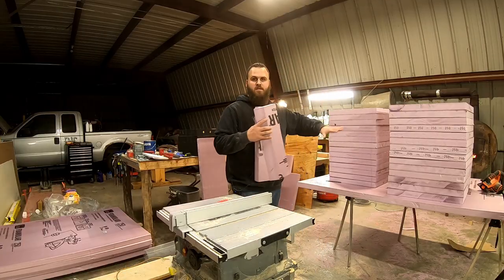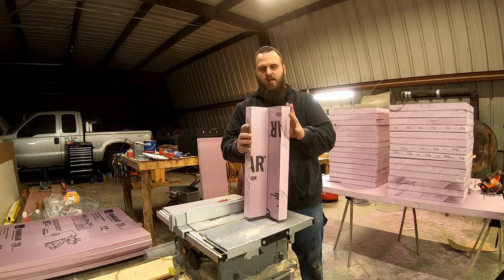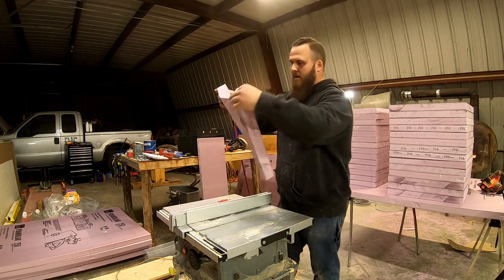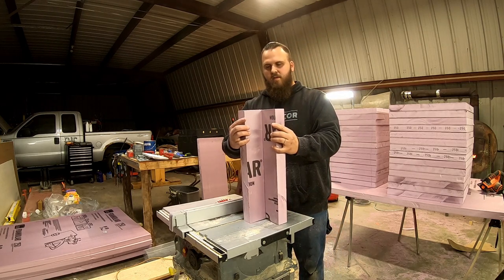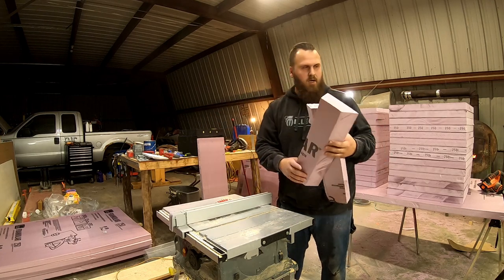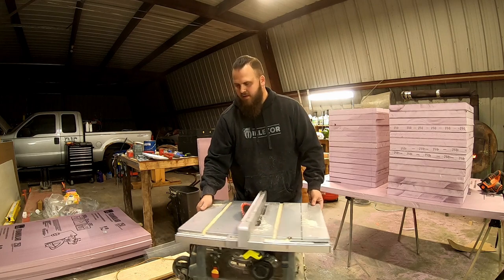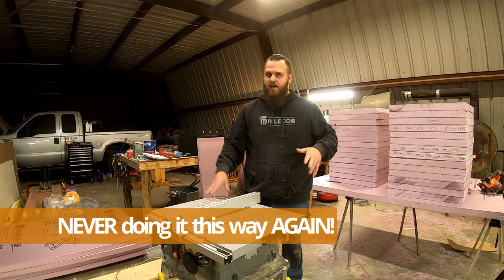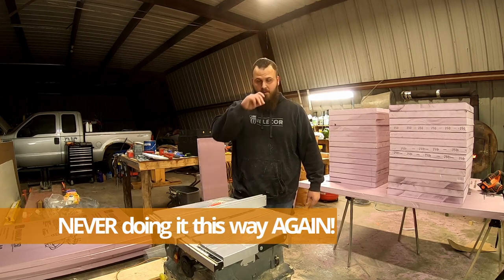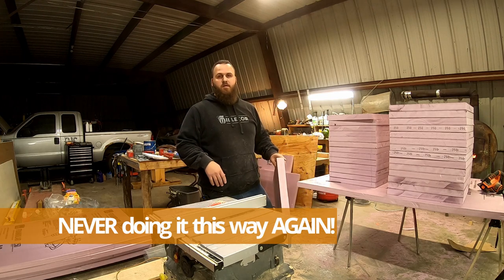I got all the pieces cut. My next part is going to put the 45 in on each one, so when it comes together it's like that. When I have this laying flat, we're going to use 3-inch wide Gorilla Tape on the outside seam so that way it'll be sealed — and when you close it off, it's got a nice good seal. We'll wrap the ratchet strap around it. Now to make this 45-degree cut, I'm going to use the table saw with the blade at 45 degrees. You've got to go slow with it because the blade every now and again likes to catch the foam and kind of jerk it a bit. My side pieces are going to be 24 by 24.